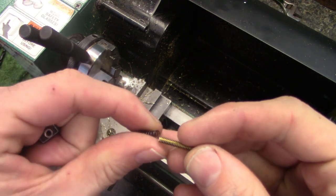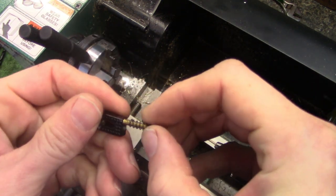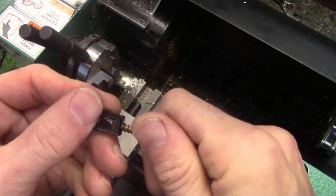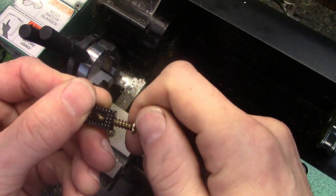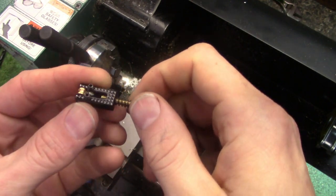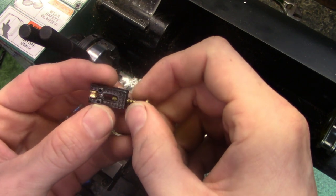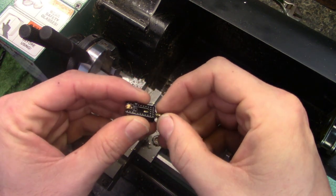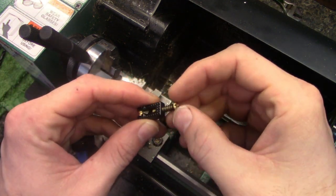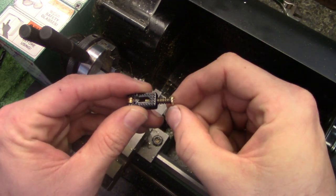Now once you get done with that, you pretty much got this guy here. Now all you need is your spring, and then this guy here. And there you go. You've got a string-through saddle. Very easy, very simple to do. And like I said before, the only real modification you have to do to the bridge with one of these is make sure that the hole is big enough to accept this 6/32 screw.